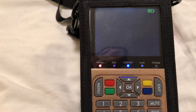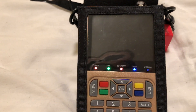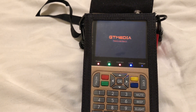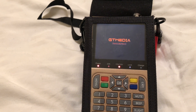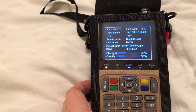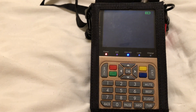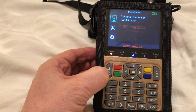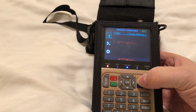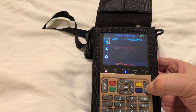When you switch it on you'll get an initial screen - let's just do that now. It boots up and you'll get this initial screen on the sat finder. This one is a V8 Gold by the way - Gold is important because it has the USB. You'll get this display come up, so just hit the info button three times at the bottom and you'll get rid of that. Press the menu button and you get 'Antenna Connection' and 'Satellite List'. When you're first setting this up, go into Antenna Setting and just set for fixed antenna - you don't want motor antenna, you just want fixed antenna.